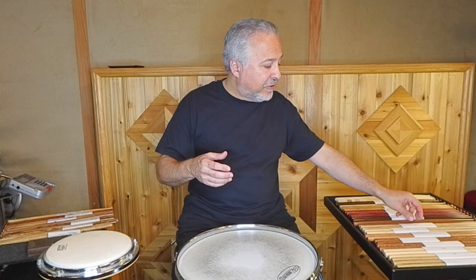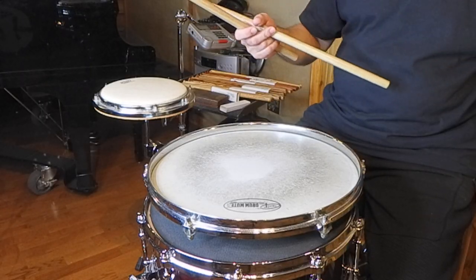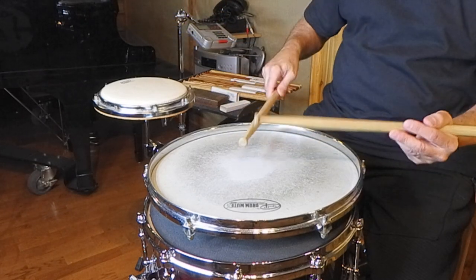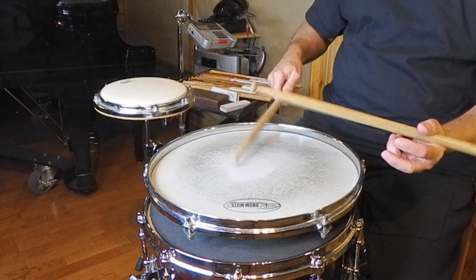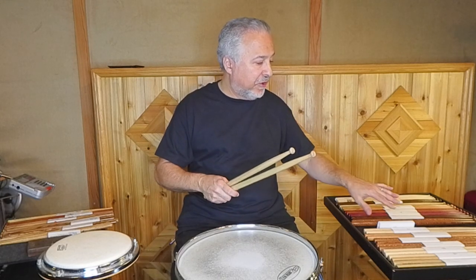And then everything on the outer part, depending on the kind of wood, is sapwood, and the heartwood's in the middle. Now, most trees have very limited heartwood. So persimmon has very, very limited heartwood. This is persimmon, one of my favorite woods, everybody's favorite wood for sticks. It's got the perfect balance, weight, and doesn't have vibration. Very similar to all these I use, but persimmon tends to be a little bit lighter than all these other woods, which I like. It's like the perfect weight.